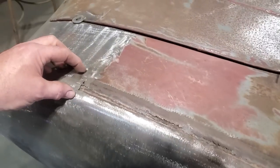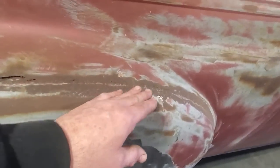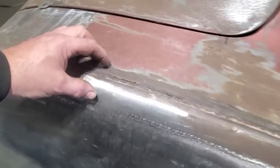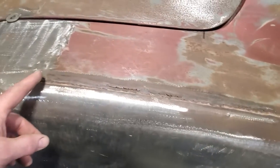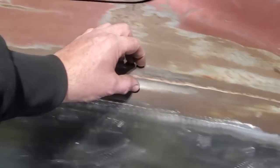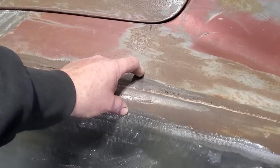I'm just going to get strips now. I'm going to cut them probably an inch and a quarter wide or so and come up here. I'm not going to make a big long piece going from one end to the other. It'll get tangly, and the problem you get when you start welding larger pieces is that it's going to want to turn on you, and then you can't bring it back. You've got to cut it to bring it back. So I'm going to cut a piece about 24 inches, do the cut and butt in there, and then just move on from there, going right on up and making a full piece to go in there. So I'm going to go ahead now, cut out a piece and get started.